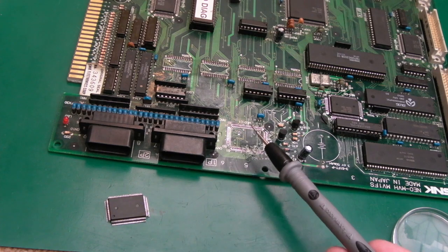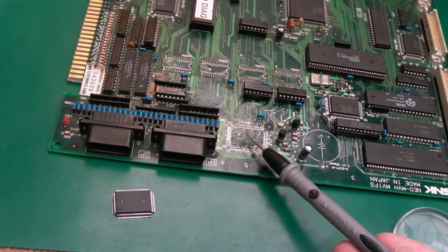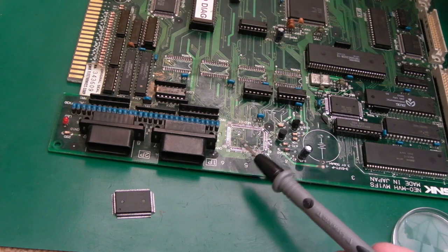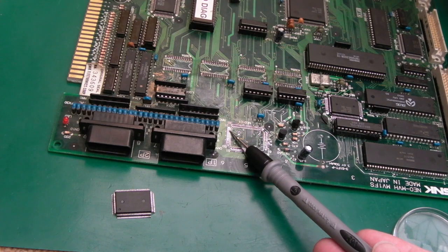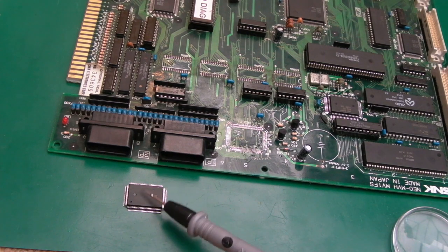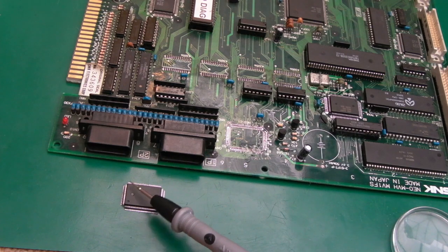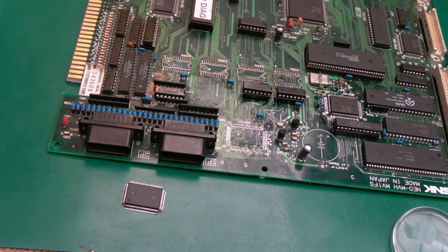So I thought it must have failed, that must be the fault. So then I spent quite a while getting the chip off. The first time it came off within a few minutes. It took me about 6 minutes to get that off last night. And after I removed it, measured on the board, the short's gone. Measured on the chip, the short's gone. But the behaviour was the same. So I don't understand, it's almost like we've got an intermittent short between a couple of the pins there.